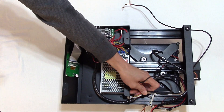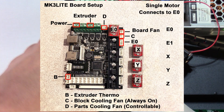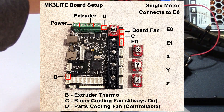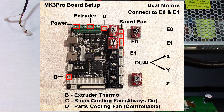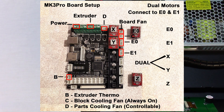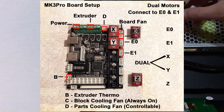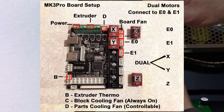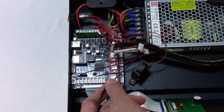The X wire, attached to the main wire array, is for the dual motor users. If using the MK3 Lite single motor system, remove the X, Y, and Z boards. If using the MK3 Pro dual motors, remove all the stepper driver boards and use the X and Y stepper driver boards, swapping them over to E0 and E1. The extruder and X wires will be plugged into E0 and E1. Zip tie remaining wires to the power supply where you cut them off from initially.